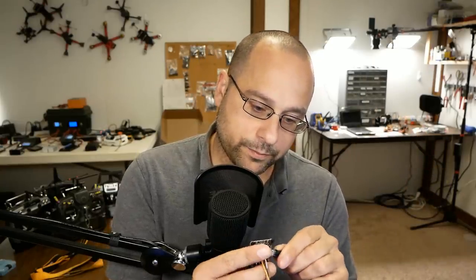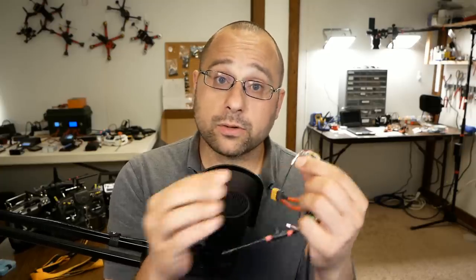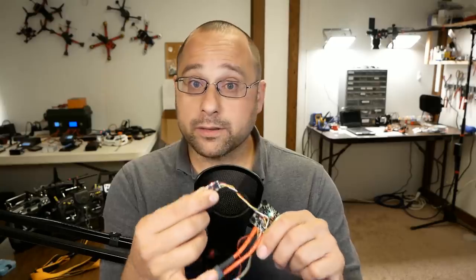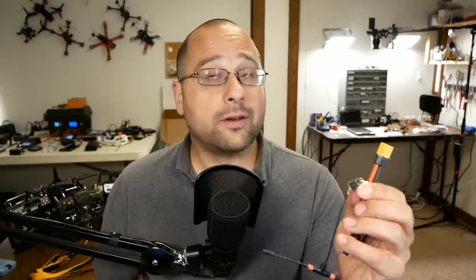If you're running an F4 or F7, it may be as simple as just plugging in USB to your flight controller. You can see that on this flight controller, which is a CL Racing F4 — when I plug in USB, the receiver lights up. Some flight controllers will power the receiver from USB, and that's the best case scenario because you just plug it in. If it's a spare flight controller like this one, you don't even need the XT60. But many flight controllers do not power the receiver when you plug in USB — you're going to need to plug in a LiPo. In that case, you definitely want to take your props off. Don't plug in an XT60 and do this with your props on. Also be aware: if you plug in a LiPo, your video transmitter will turn on, and if it's sitting there at 800 milliwatts just running on the desk while you're playing the simulator, that's not good.